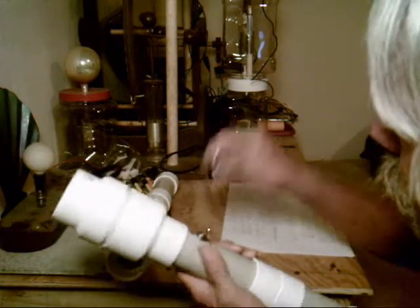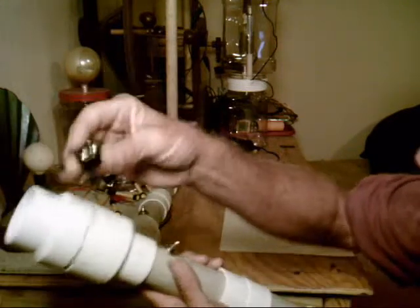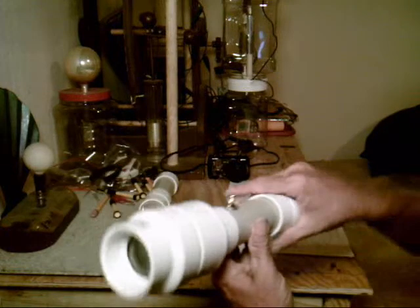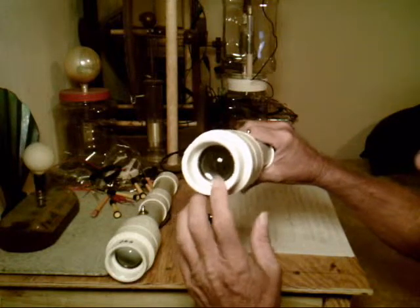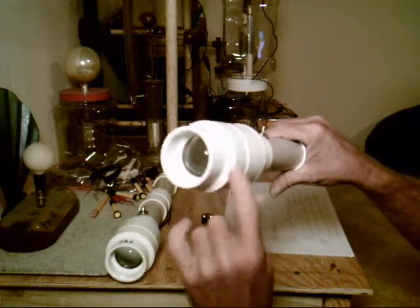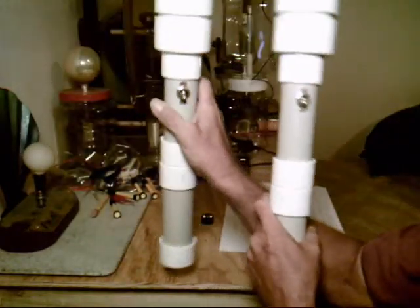To get some decent distance out of them, each light has one of these reflectors mounted over it. Each light also inside is mounted on a black star heat sink. It also has a 50mm spherical lens at the end between the cap and a 2-inch pipe. That lens is convex on the outside and flat on the inside. One is 850 and one is 940.